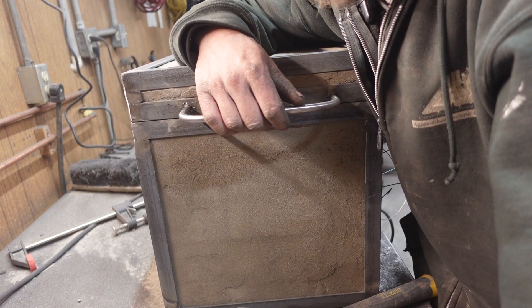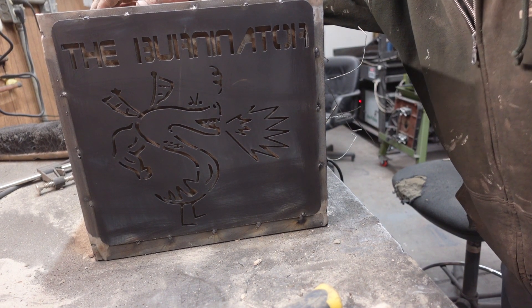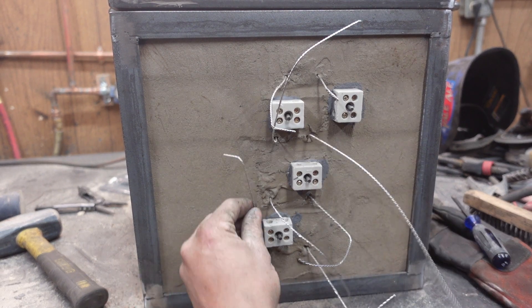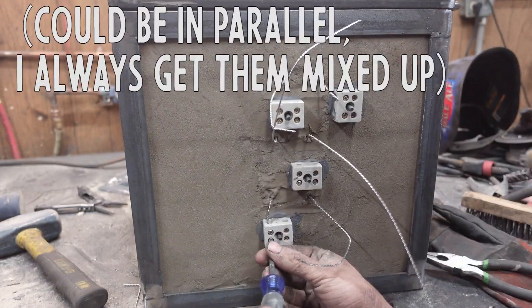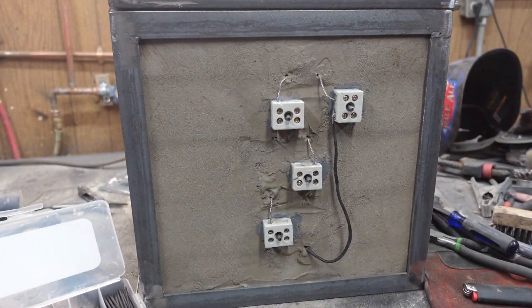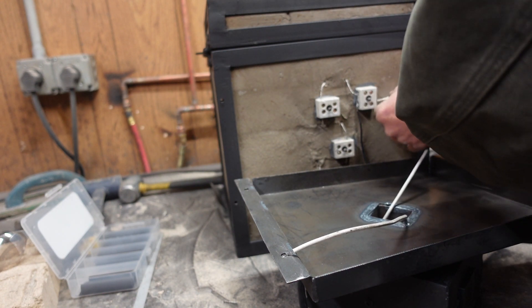I think that's about it for the welding — oh hold on, the finishing touch. Look at this freaking thing, beautiful. So we can start by hooking up these coils to their appropriate spots just to get them out of my way. These are being hooked up in series, I believe. Now we can hook our PID up to the coils, install this plate, put in the thermocouple, and we're good to go.